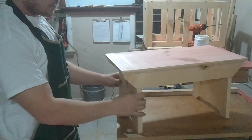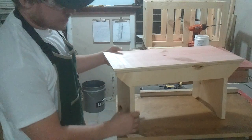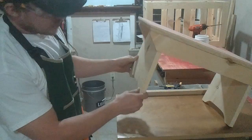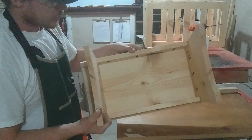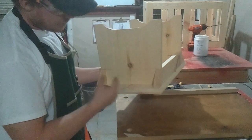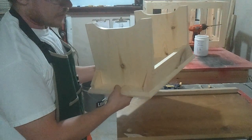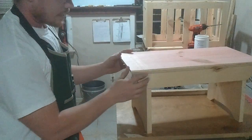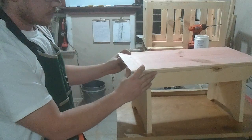Here it is completed — just a simple step stool, children's bench, whatever you want to call it. I used scrap one-by-twelve material; I think you can make one with about six feet or so. Some pretty nasty scrap, actually — I've got a hole that goes all the way through one piece. About 20 or 25 pocket hole screws, real simple construction. You've got a couple of cutouts on either leg, which means whatever weight you put on the top transfers to the side rails and goes right down into the leg — it's going to be very strong in its own right.